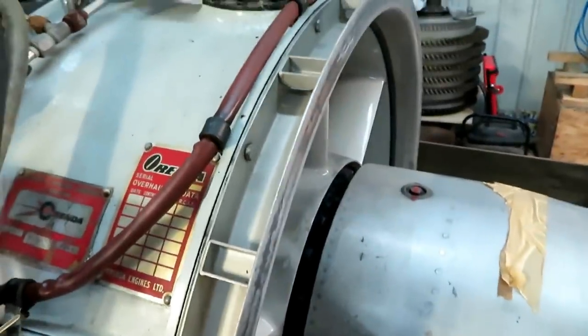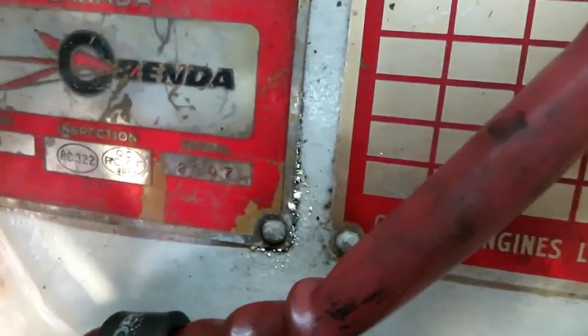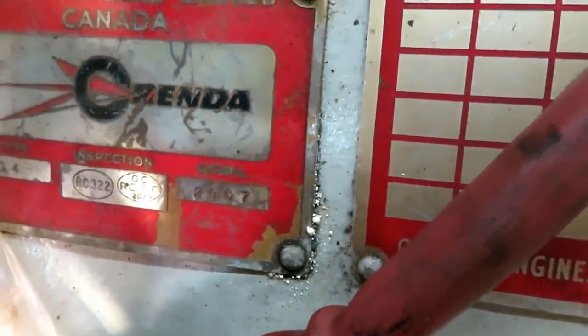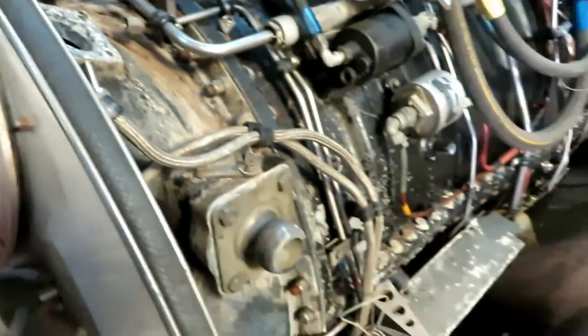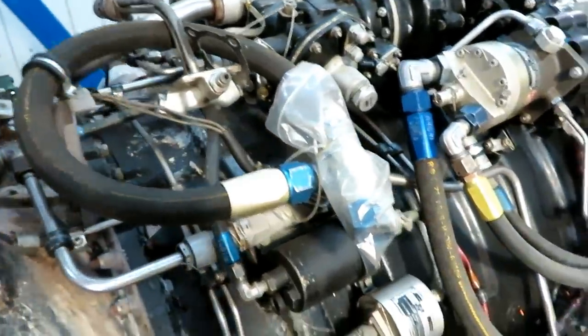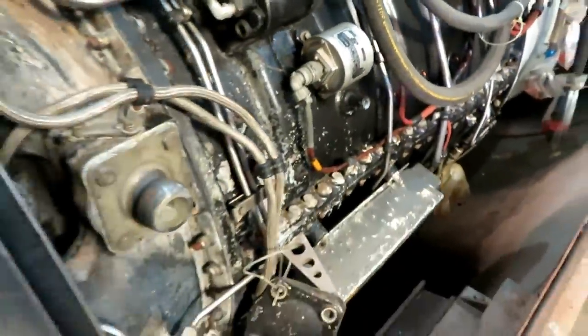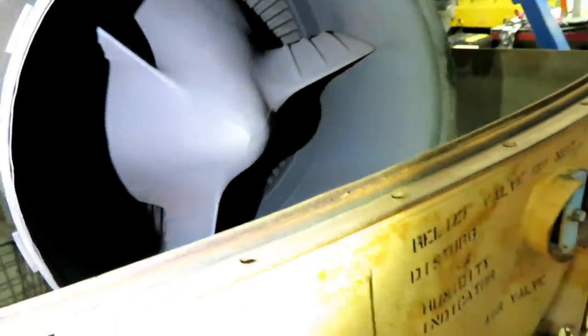I'm intending this engine to become famous. What is it now? It is 2907 — that's what it says. All the hoses and tubes and whatnot are a little worse for wear, but really it's a pretty good candidate for a donor engine. It doesn't look too bad at all. Turbine blades look pretty good — no cracks, no damage, no impact, no bullet holes. Very good.